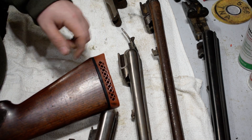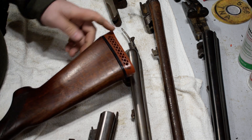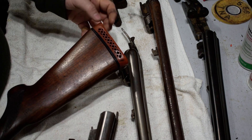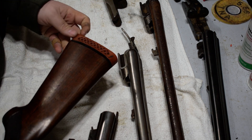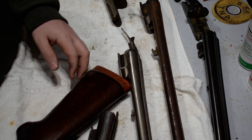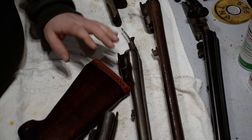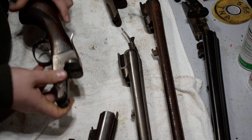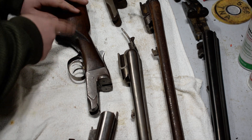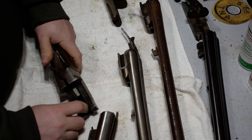Something less critical: if the toe is blown off — you see this especially on surplus rifles with a screw for the butt plate — somebody might over-crank it or drop it at an angle causing excessive pressure, and it pops. Not critical, it can be fixed: get a piece of walnut with a similar grain, glue and screw, or just sand it off flush. But the main thing to look for is in the wrist: oil soak, cracking, or tang cracks. Oil soak — just avoid it unless you're looking for a serious project.